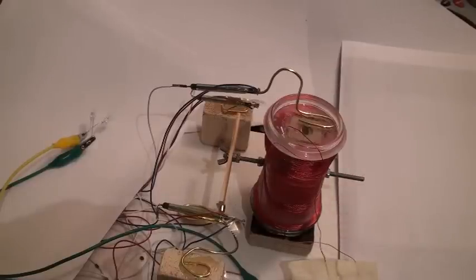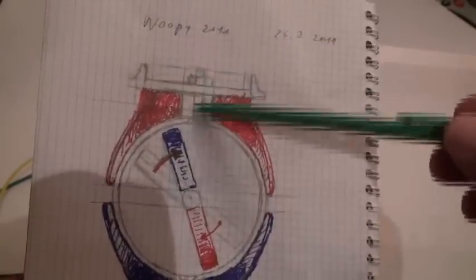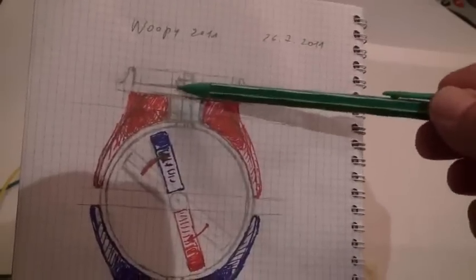Of course this winding is very special — it is about 6.6 kilo-ohms resistance and probably more than 20 Henrys of inductance, because my L-meter cannot measure such high Henry values; I will need to buy something better. What is very important — and I ask you — is this an acceleration and intensification of the magnetic flux here, which could improve the whole system?